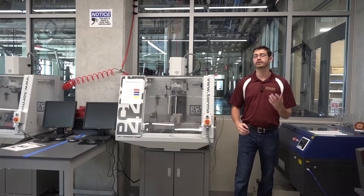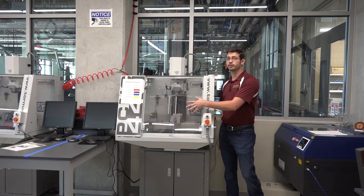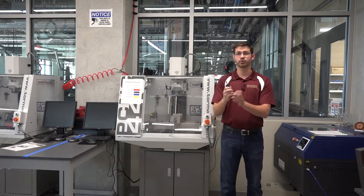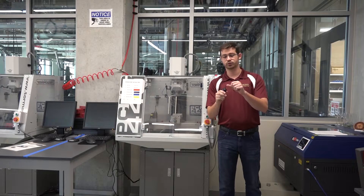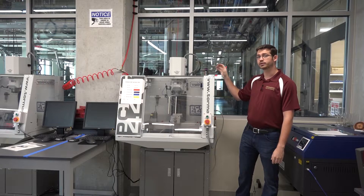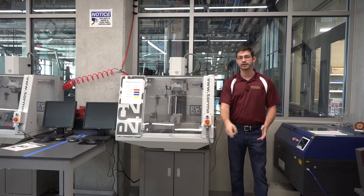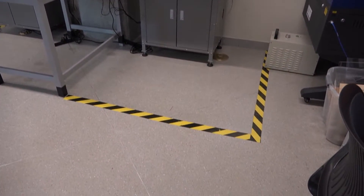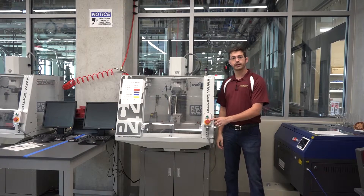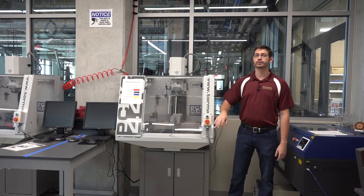Also in the RPM is our entry-level CNC mill known as the Tormach PCNC 440. While this machine can't actually operate with the doors open, you can cut yourself on the tooling itself, which is why you want to hold on to the bottom or the shank of the tool, not the actual cutting edges known as the flutes. This machine can still spin with the doors open, which is why you never want to grab it when it has any sort of momentum. You'll also notice a black and yellow safety line at the bottom to mark off the operator area, which is for one operator at a time. Lastly, there's a big red emergency stop on the front — if anything goes wrong, like a fire or a major crash, do not be afraid to hit this button.